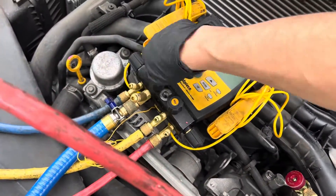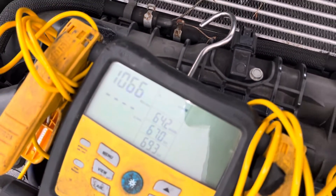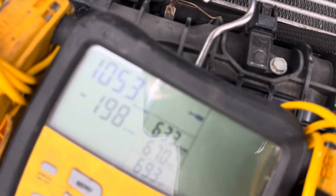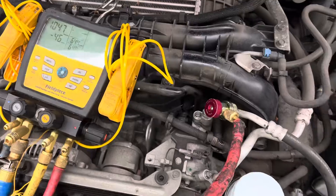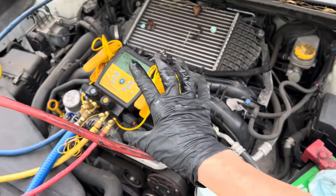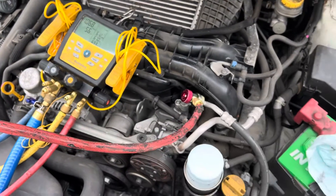Let's turn off the vacuum. There we go — that's with the vacuum off right now, steadying out. You can see it's open here, open here to the system, and just by putting Nylog on my finger and smearing it where there's a vacuum leak and a pressure leak, it stops the vacuum. That is what Nylog does — that's why you put either silicone grease or Nylog on your o-rings and then assemble the system back together.